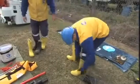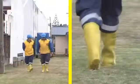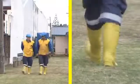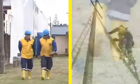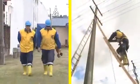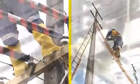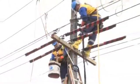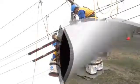After the field test, the boots must be worn for the total duration of the outage. Dielectric boots give the worker complete freedom of movement around the site, as they provide isolation from any step potential that may exist. The added benefit aloft is that the boots help prevent contact between the worker and the pole. This protects the worker from a potential voltage difference.